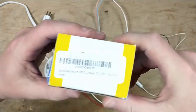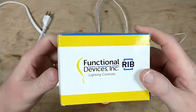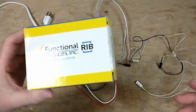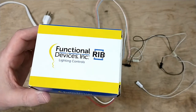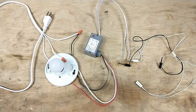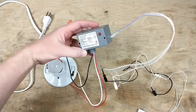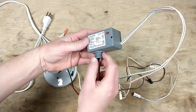For the control logic I bought this little thing from a company called Functional Devices — I bought it on Amazon. If you watch any of my videos you know I buy almost everything on there. This is just a little switching mechanism that lets you use a low voltage switch like an alarm contact to switch something that's high voltage like a light. High voltage is more hazardous because it could shock you; low voltage is less hazardous. Consult your local building code. This is the actual module — I've breadboarded the whole thing to make sure it would work.